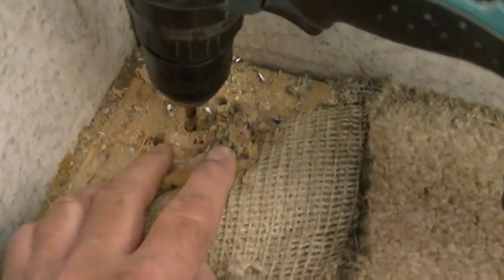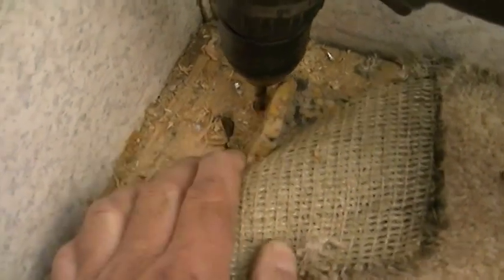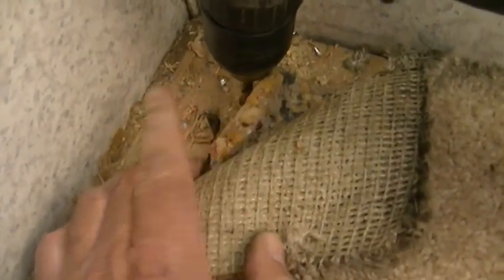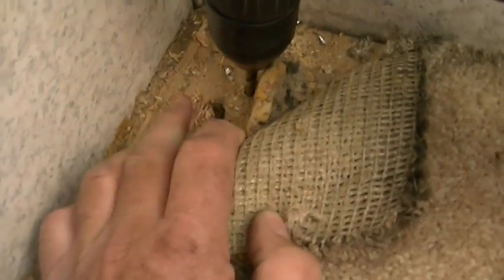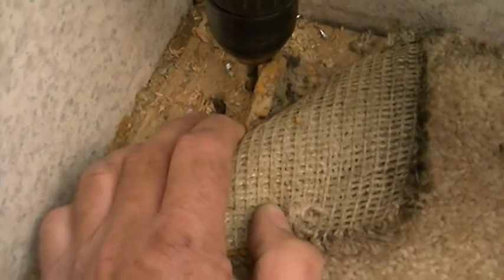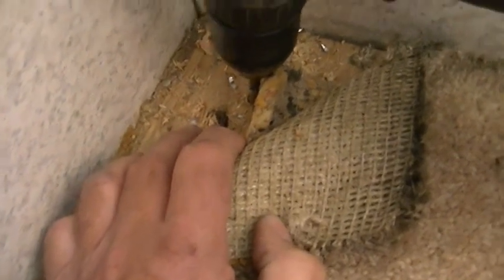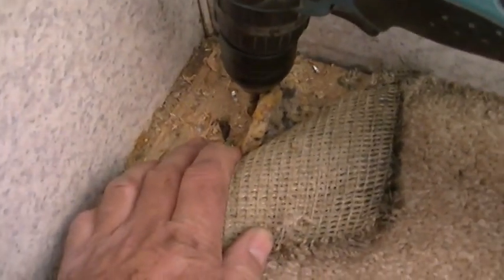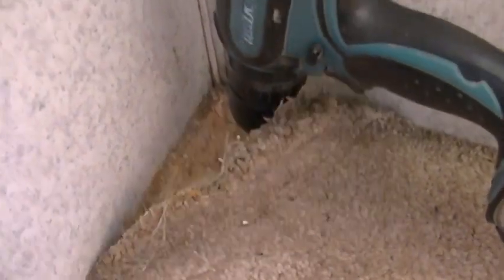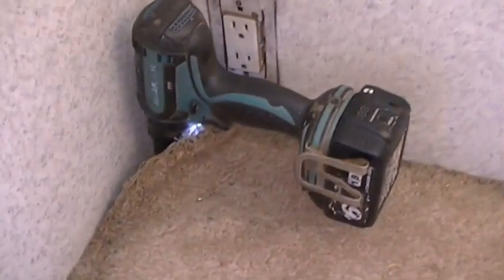And so this hole here, my finger here, I'm pointing to it, is the one that has 1¼ inches from both the back frame and the side frame. So that's where I'm gonna drill the hole. So, you know, start drilling some holes. You can caulk them up later to seal them off, but you need to find the right location, and I'll show you from the bottom side what you have to do to make sure you have no wires or anything in the way. So that hole I found was the right one. So I'm gonna go ahead and stick it in that hole. Okay, just like that, and I'll show you from underneath what I did.